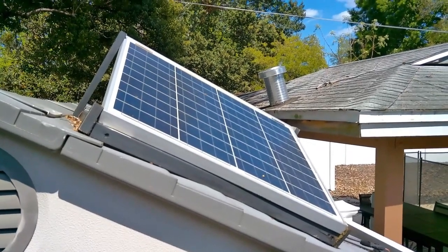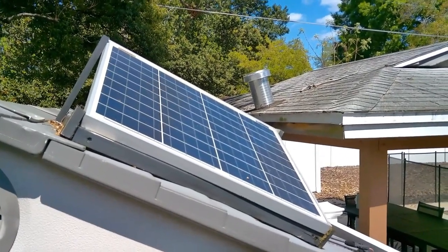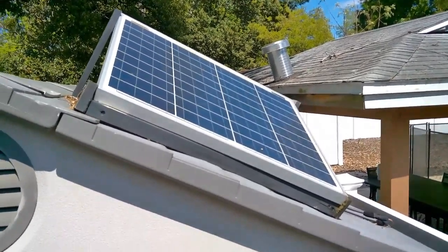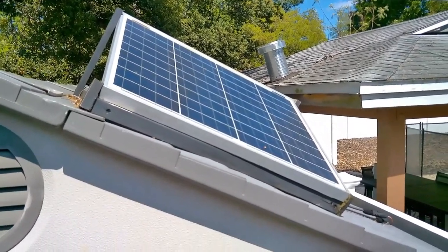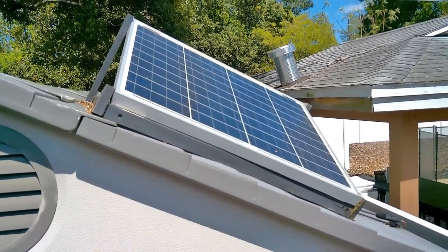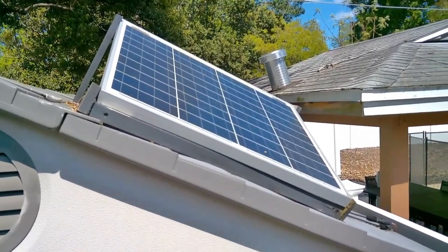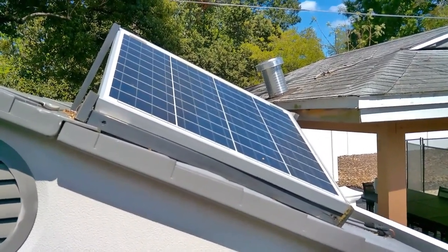Right there is my panel. It's a 100-watt panel. Of course there are several makes, but if you get a 100-watt like this one, you're going to get probably about 700 watts of power during the whole day into your batteries, which is plenty. When you do buy a panel, look for one that runs about a dollar a watt. That way it's relatively inexpensive and they pretty much all work great.